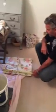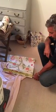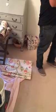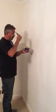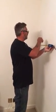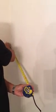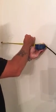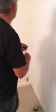So you'll measure that again in a minute? Well, yeah, because it was just under 21, and with the paste on it, it'll stretch now to 21 inches. Good. So now we know we're going to have 21 inches. That's where old age comes in, and I need the glasses, otherwise I can't see. So basically I'm going to go a little under 21, so the paper will go around there a bit, and then I can cut in. So literally if I go 20 and 3/4, and then get my plumb bob, then we have a nice straight line.